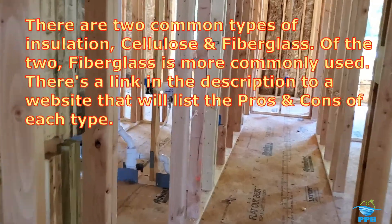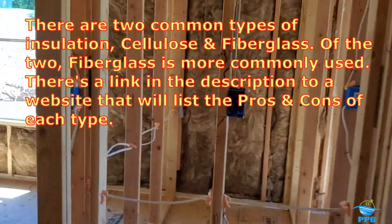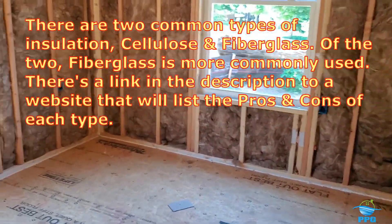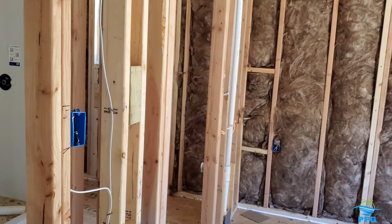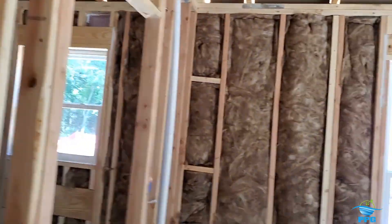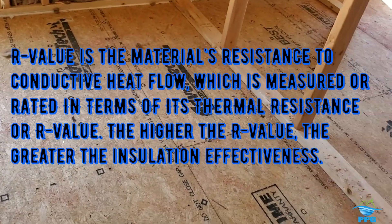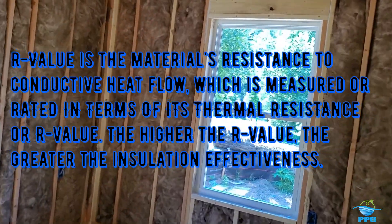Let's get into what I look for when I'm doing an insulation inspection. Definitely after the roughs have passed — the electrical, mechanical, plumbing — and the framing has passed, the next step is insulation. Down here in Georgia, we are under the 2015 energy code. With that, a couple things changed. The attic insulation went from R30 to R38. The walls are R13, and under the floor if you have a crawl space or basement, it's R19.